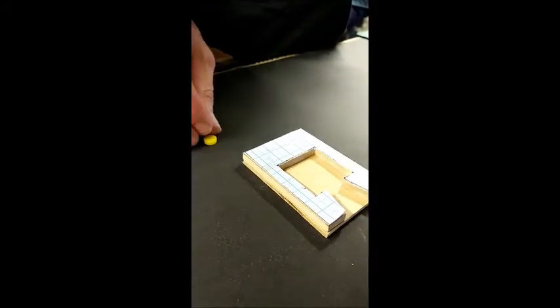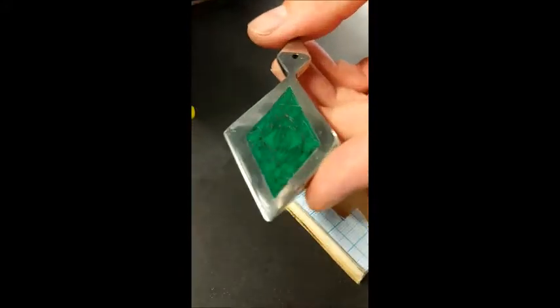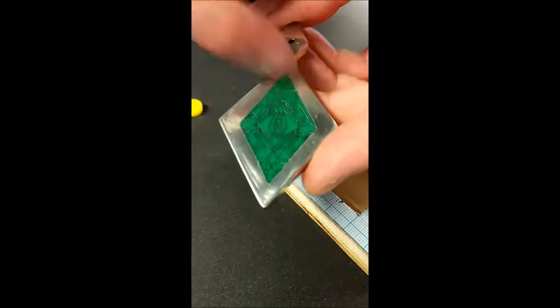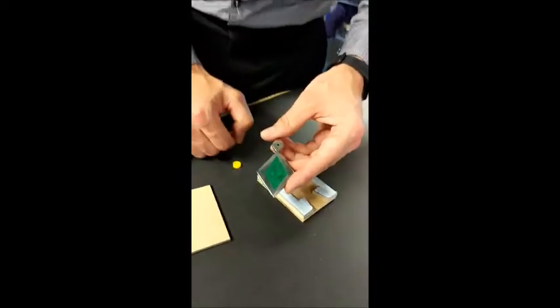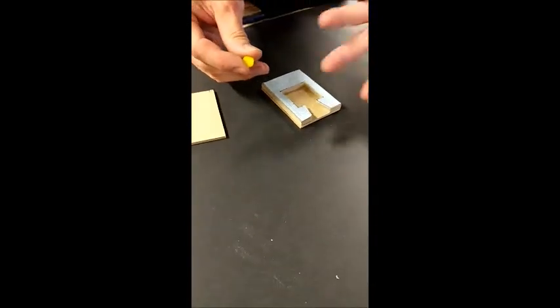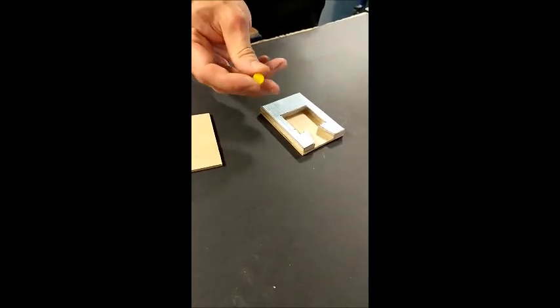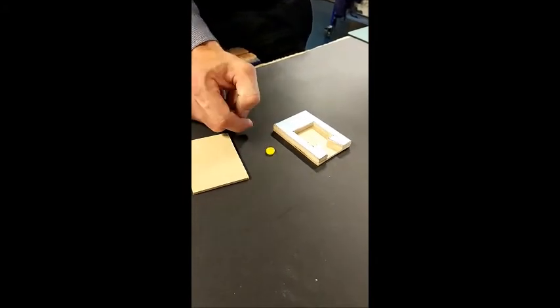It's just a simple insert, but obviously what I could do, if I'm quite skilled with CAD software like 2D Design or Illustrator, is design and engrave details on there — acrylic engraved with designs and patterns. Now, this little insert — you'd think because it's acrylic it's going to melt, but the heat of the pewter cools very quickly, so it's not actually hot for long enough to do too much damage. The only issue is if I use an acrylic piece that's very thin — sections of maybe one or two millimetres may well be damaged or reduced in size.